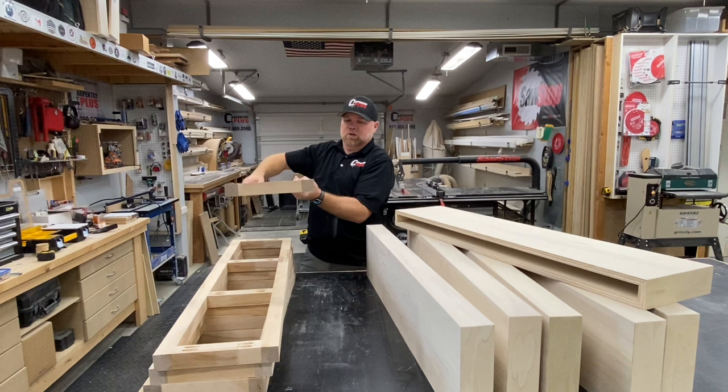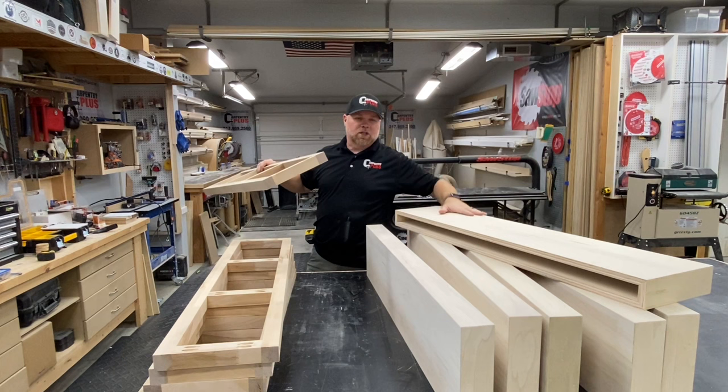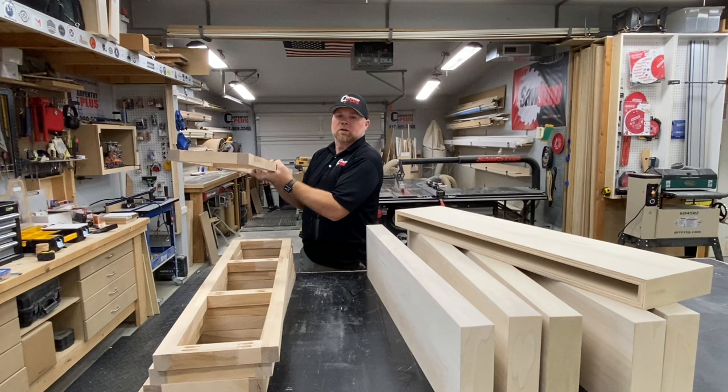This is kind of where it starts actually, is 1.5 inches here. Anything less than that, I don't feel like is gonna be strong enough. So that's kind of where this 3 inches comes from, is from this 1.5 inches plus our 3/4 to give us the 3. So anyhow, once this is anchored to the wall, we like to use some ledger lock lag screws for that.